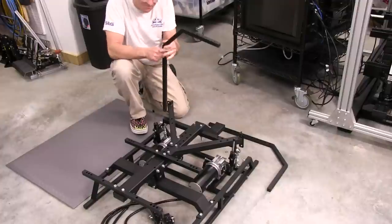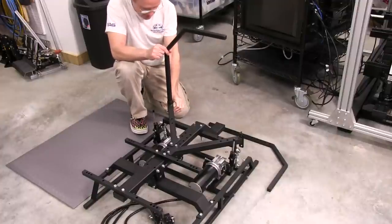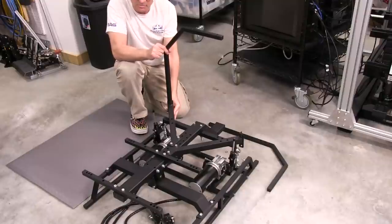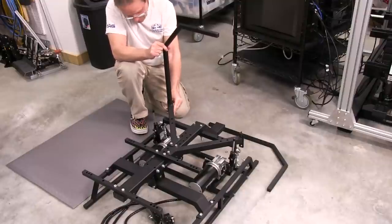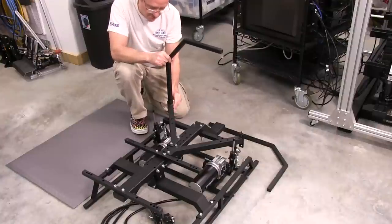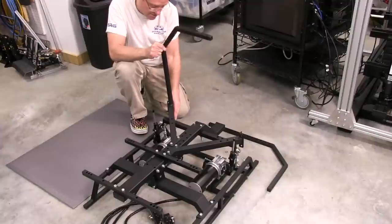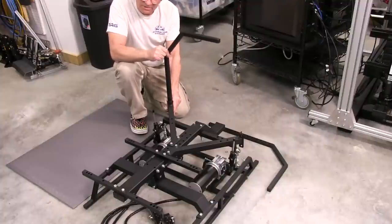Here's the thing with this, and you can see it right away. It's probably not going to be the most robust type of wheel mount, or wheelbase, but we'll see once we get it all bolted up. But the lower you go with this, as far as mounting this in the bracket that we already put on in the last segment, the stronger the wheelbase is going to be.